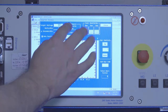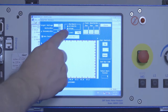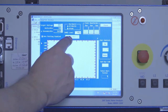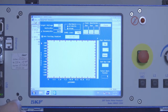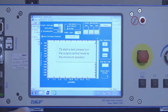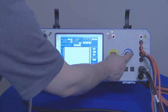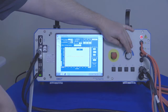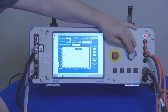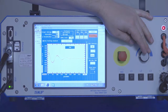If we were using a power pack capable of testing armatures, we'd select the power pack feature. I also want to set the EAR limit appropriately to indicate a failed test. To initiate the test, we're going to push the test button. Make sure the knob is at the minimum position to start, then increase the voltage manually until we achieve the desired test voltage — in this case, 400 volts.